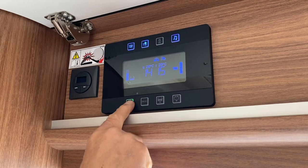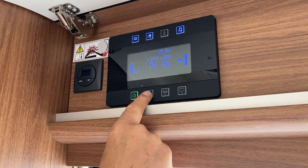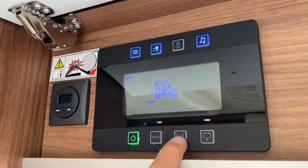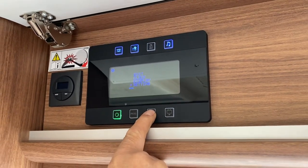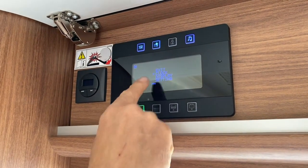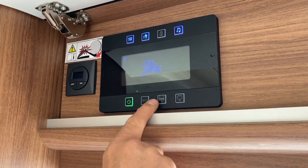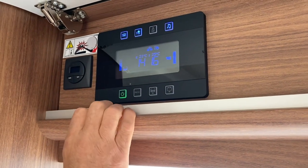On the bottom, the 'Program' button has various settings. You'll really only be in there to change the time when the clocks change. Press and hold Program and you get the settings page. To change the clock, navigate to the clock icon, press Program, then use the up or down arrows. I'll exit that — you can have a play; you'll do no harm exploring what it all does.